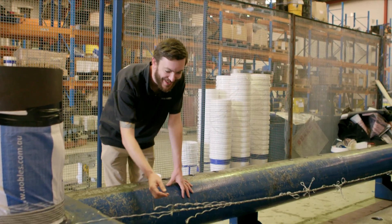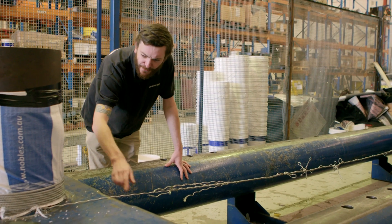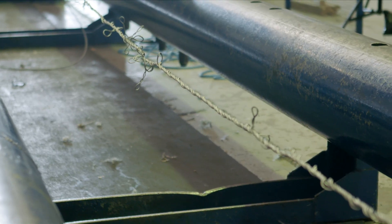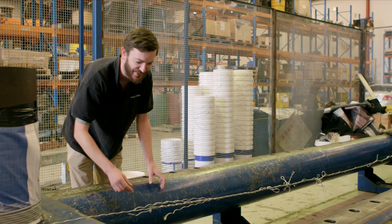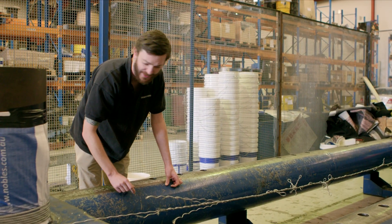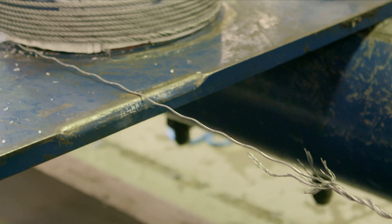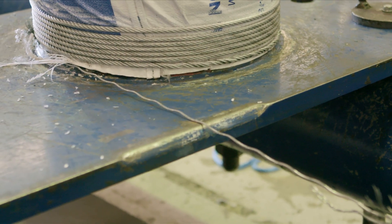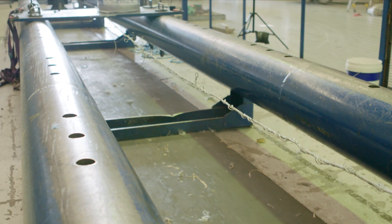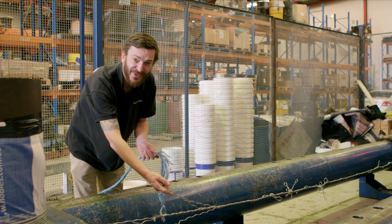So how's this for a result? The wire cable didn't snap either, but basically it's unraveled itself from the drum end. The crimp itself held up well, but the rest of this rope just looks like a medieval torture tool — it's awful and sharp. I don't even really want to touch that to be honest. It did break a little bit higher up compared to the synthetic rope, breaking at 6.1 tonne. So there's probably a little bit more strength in it, but considering how much nicer and softer that synthetic rope is, I'd rather have that coming at my head than this. That's scary.